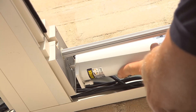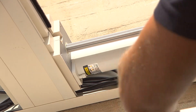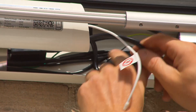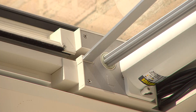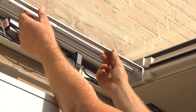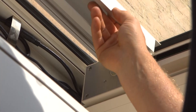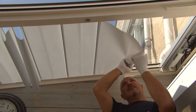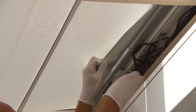Mount the motor at the top — it will sit on the left. It clicks into place and is connected immediately, so you don't forget. When you are done with that, also mount the fabric tensioner, where the fabric will be attached to make sure it stays under tension. Do this with the slanted side up. At the top, there will be another protective cap so that from above the whole system is hidden and protected. Then slide the cloth all the way to the top and fasten it to the cloth tensioner with the clips. Make sure you tighten it properly.